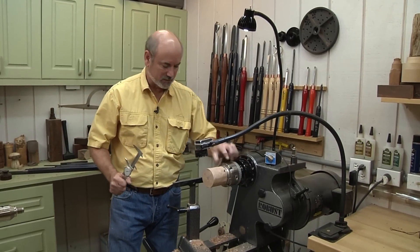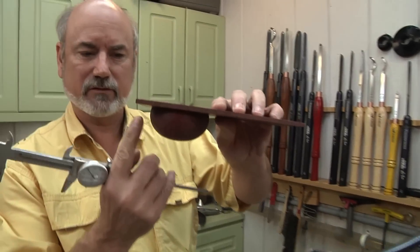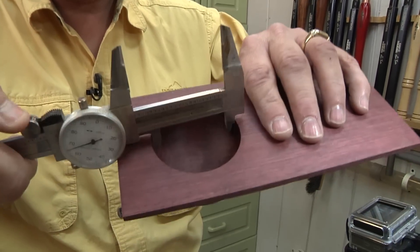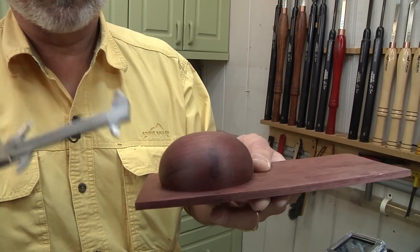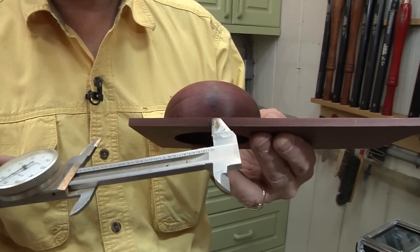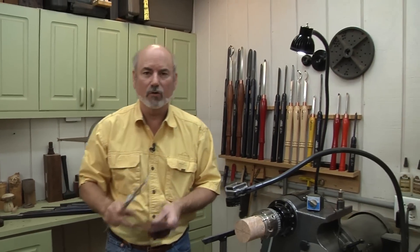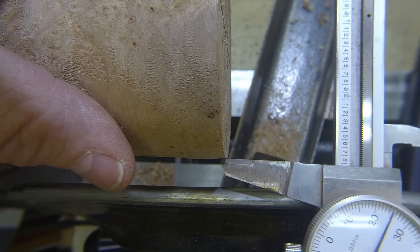We have our blank now mounted in the chuck and it's holding really well. The shape I want to make for the lid is a continuation of this shape — I want it to look like this weird shape is continuing upward. You'd think you'd come in and measure the width to get the blank size, but no — we want to come out here and get the idea of that shape, and think about how much thickness we have to go through. I'm going to take the jaws and move them in just a bit more, and now I'll have what looks like a seamless ball going through this wood. I'll take my calipers and check — I'm almost to the perfect dimension.